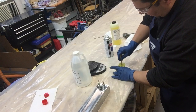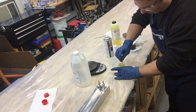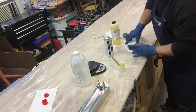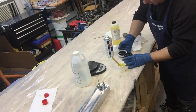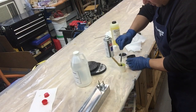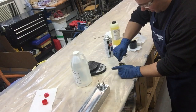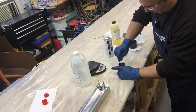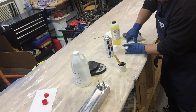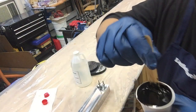This cup is just barely big enough, and you don't want to whip any bubbles into it because then bubbles will end up in your part too. I'm going to mix this thing and while I'm doing the mixing, I'll add a little bit of this tint. It's kind of liquid — I don't know how much we need but I'll just put some in there and see what happens. This is really dark — I think we might need even less than that. This thing is jet black with just a little bit of tint.